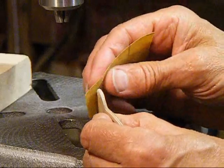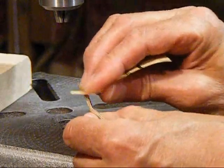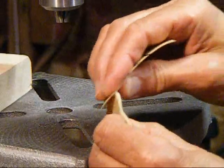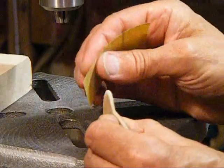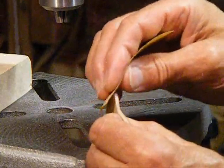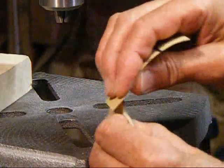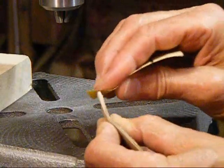Using small pieces of sandpaper, you can round and break the edges. I would use a coarser sandpaper to start — maybe an 80 or 100 grit — and then finish it off with a 220 or 320 to get a nice, smooth rounded edge.